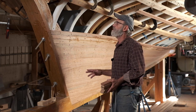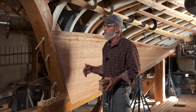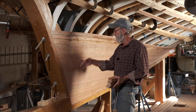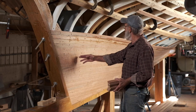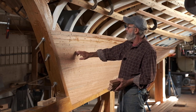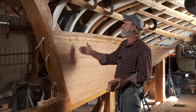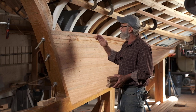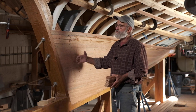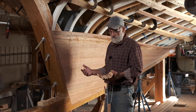This was just something that I came up with, and this is the first opportunity we've had really to see how well it works. We've got quite a bit of it on already. This is all sawn to a progressive bevel so that the glue line on the inside of the boat and the glue line on the outside of the boat look exactly the same. It's really nice — you don't use that much glue, it mates up really nicely, and it does a terrific job.